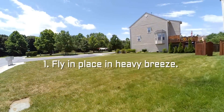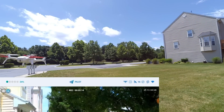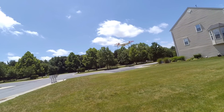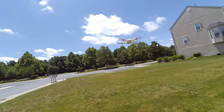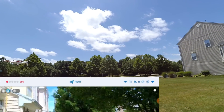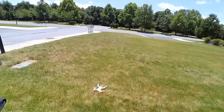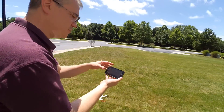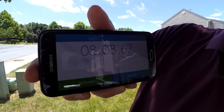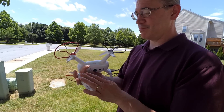We're flying it now and right now it's just staying still. You'll notice it's actually doing a pretty good job — I've split up the video here but notice how it's fighting the wind, so that's important to note. I'm going to stop it at 20%, because if you go below 20% you're looking for trouble and you're going to hurt your batteries. And we got eight minutes and eight — 8.8, not bad. Eight minutes, eight seconds.